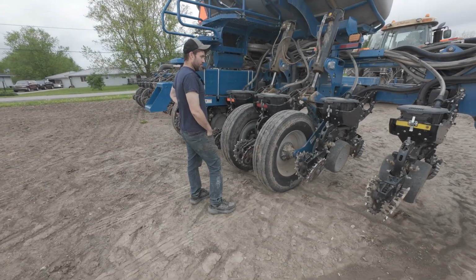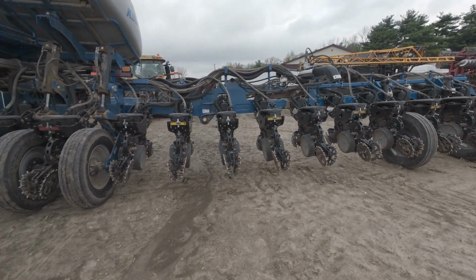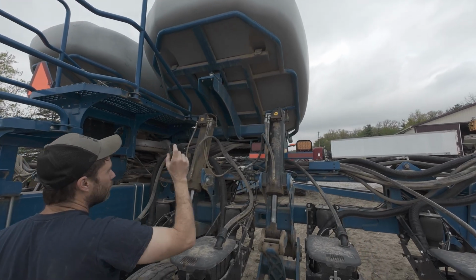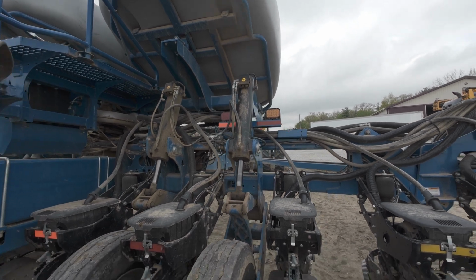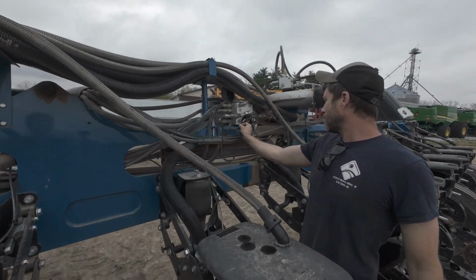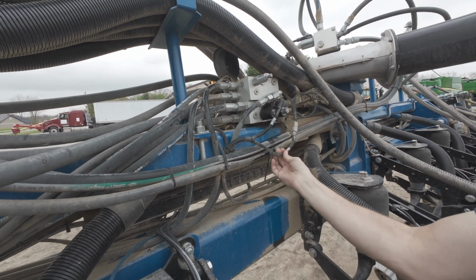And then you'll go through the field and it'll do this, because all the weight will be on that one, and this side drifts down. There, I've swapped them. I've swapped whole valve block assemblies. That didn't do anything. I've swapped now the lower C2, except to swap side to side, and the problem didn't move. That's the wing wheel is C2, axle is C1.